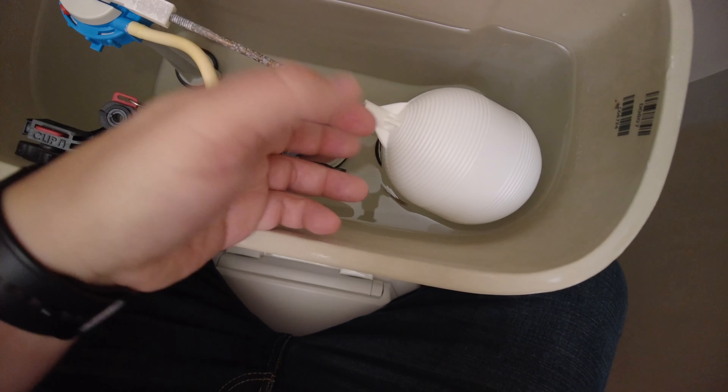One trick I like to do is to line up the chains so I can tell if there are any adjustments needed for where the hook is located before I put the new flapper inside the toilet — it makes it more convenient and takes out some of the guesswork. Now I have the chain adjusted; I moved the hook down a few chain lengths. I'll go ahead and install the new flapper. Make sure you hold on to the chain so it doesn't fall into the hole, then put the flapper in place and hook the rubber or plastic parts on to the sides.